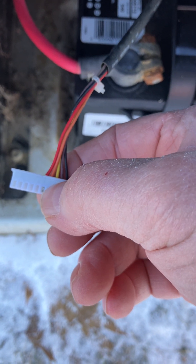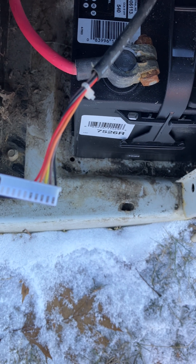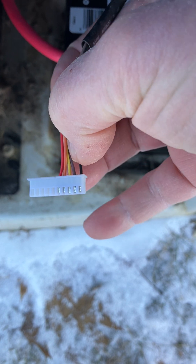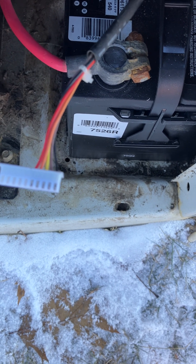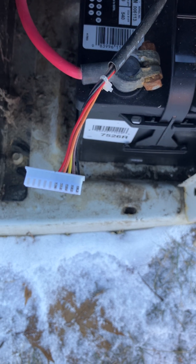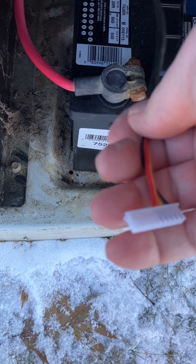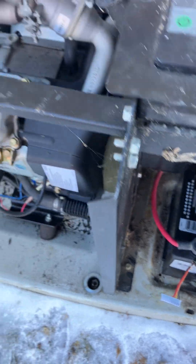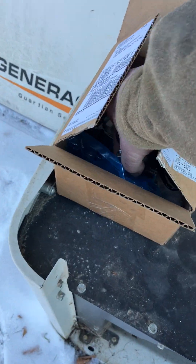From that red wire to all the other wires, if you put an ohmmeter in there and go along, you should get 10 to 12 ohms on every single leg. I had an open line on this wire on the end, which means it's broken or internally in that stepper switch it doesn't exist.